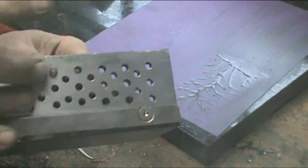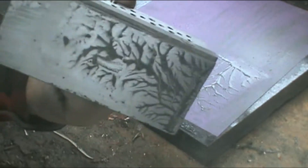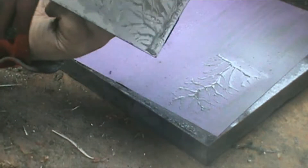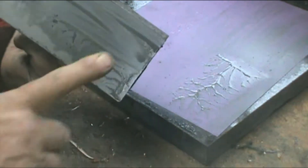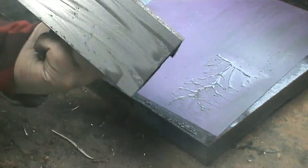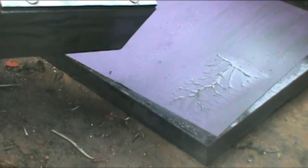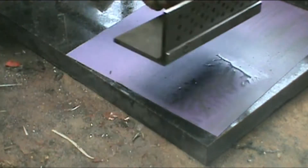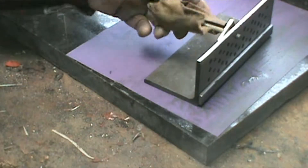What I'm doing here today — after I put this on there, drilled and tapped everything, I lapped this side right here to make sure it's flat and straight. Now I'm doing that to the bottom this morning. Don't ever, ever assume that angle iron is straight or square — it's not.